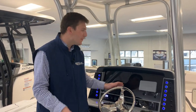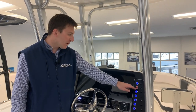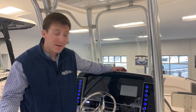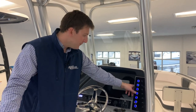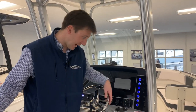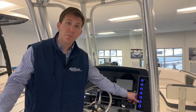Let's run through the switches on the boat. You have your horn right here with your breaker off to the starboard side of it. You have your nav and your anchor light — nav is obviously your red and green up in the front, anchor light is up on top and you use it when anchoring at night. Courtesy lights are the blue LEDs throughout the boat to light up the deck. If you want to engage the light on your livewell, you simply push the livewell light button. Spreader lights are these guys right here — hit the spreader light switch and they light up.